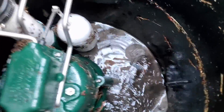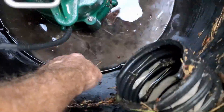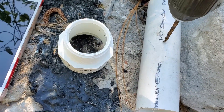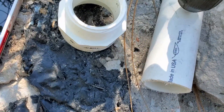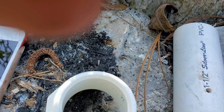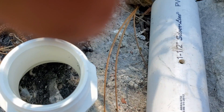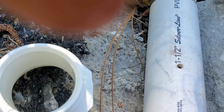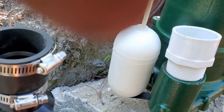I'm going to go ahead and let you see how we build the pump — remember how we set the pump up, everything that's involved. Why is that sand on one side of the pit only? Here's the first clue: remember that we drilled a 3/16-inch hole into the first riser. This is to prevent the pump from becoming airlocked. This 3/16-inch hole — the weep hole — is before the check valve. So only water comes out of that hole when the pump's on. After the pump stops, the check valve keeps the water from coming back down. That's clue number one.